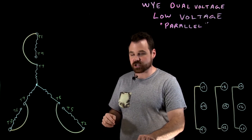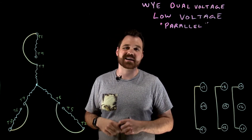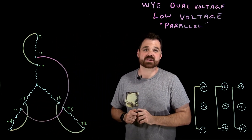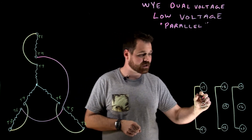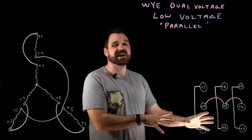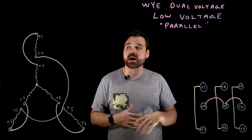That's step one in my connections. Now step two is I need to make a Y point or a star point with T4, T5, and T6 — bring those together and connect them up. So T4 to T5, then T5 over to T6, connected into a star point. These leads are just imitating the nine leads hanging out of the junction box on my motor. Thanks a bunch for watching — just a quick video to talk about this low voltage parallel connection. I hope you enjoyed it.